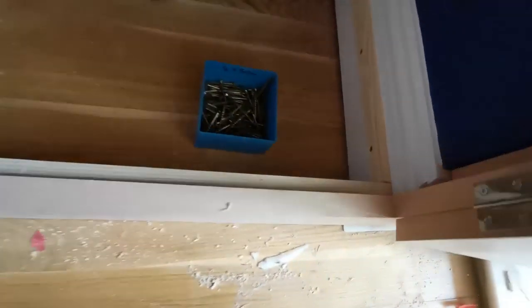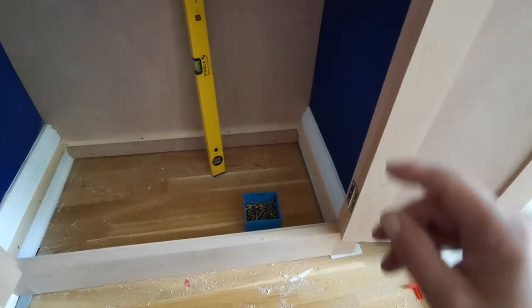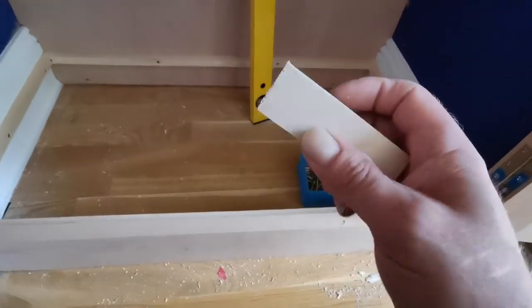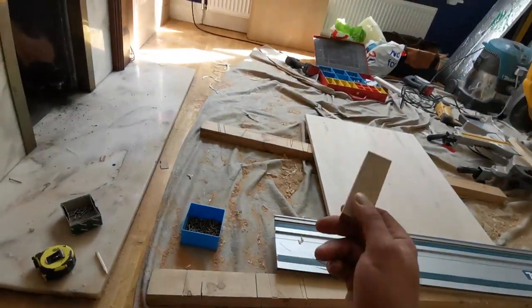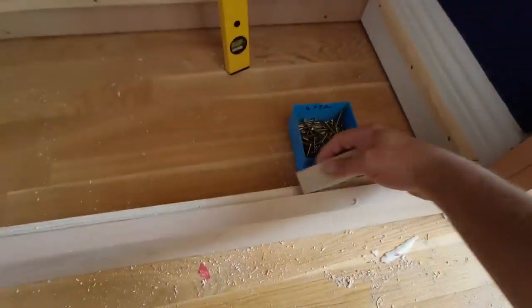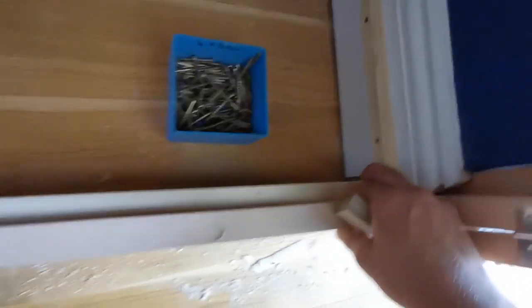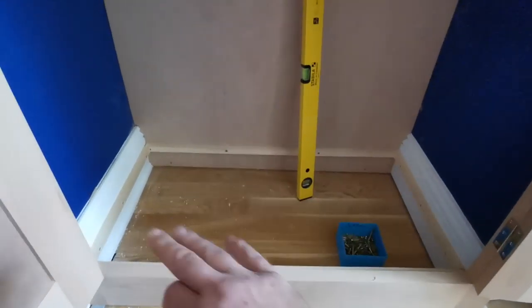Quick update: I've just put a couple of brackets either side just to hold this front in place, so this front is fixed all round. I put a batten on here — a little off-cut of the ply I'm using. I like to cut a piece off the actual stuff I'm using because it can vary sometimes in size. That's flush with there. I've only put three screws in but I'm going to put five in eventually, so there'll be a base in there.